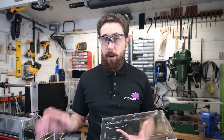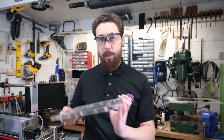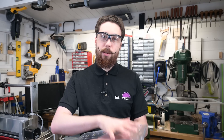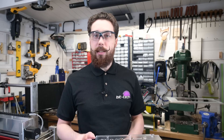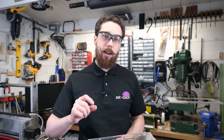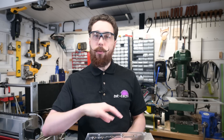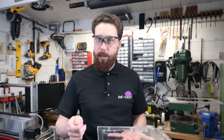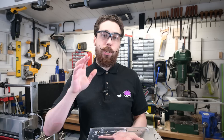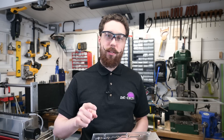In terms of what's left to do: we'll start with the aluminium, doing OP1 which cuts it out dimensionally accurate, then insert it into the fixture plate on the bed, dial it in, and do the big pocketing cut. Then we'll take it off, put it in the glass blaster to get a lovely finish, and that'll be the backplate itself. Inside the backplate we'll have an inlay made from frosted acrylic in the AORUS logo shape, fully RGB, connecting directly to the motherboard for a bit more flexibility.